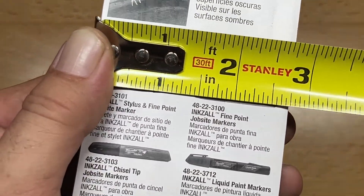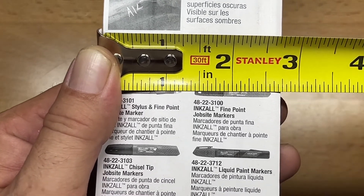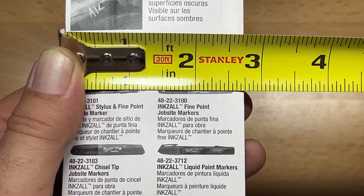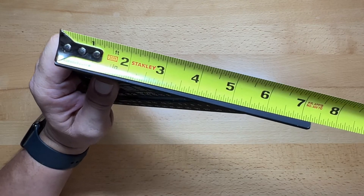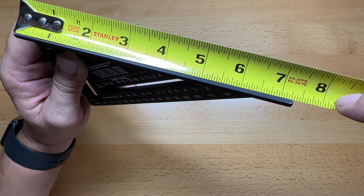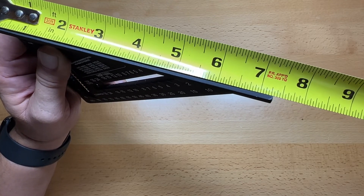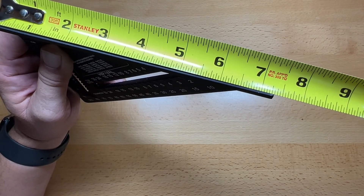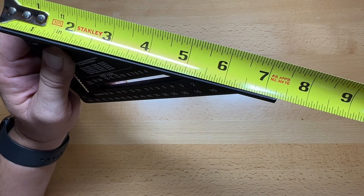If we turn the marker package sideways, by looking at the lengths of the marks we know we're on the second longest mark, so we know that's in the quarter scale, and very quickly we can determine that is two and three quarters of an inch. Now we're going to measure the length of a standard rafter square. Setting that up, we know it is one tick above the quarter inch mark — the second longest marks in that inch scale. To put the quarter mark into sixteenths, one quarter is equivalent to four sixteenths, and we add one to that making it five sixteenths — so that would be seven and five sixteenths.